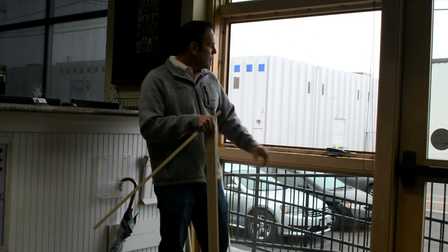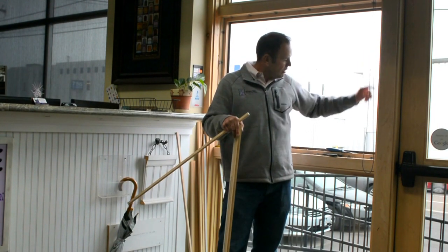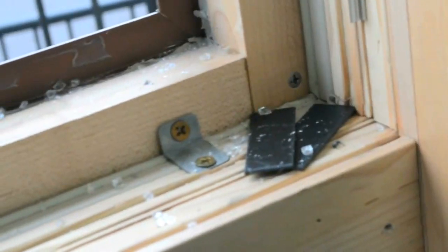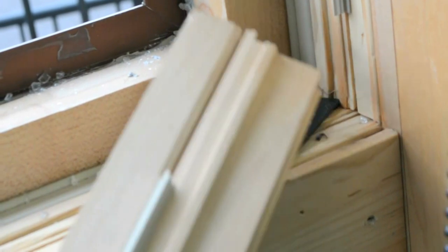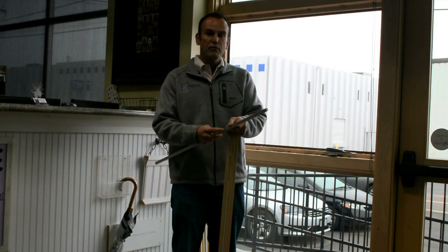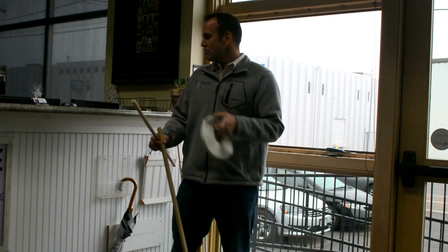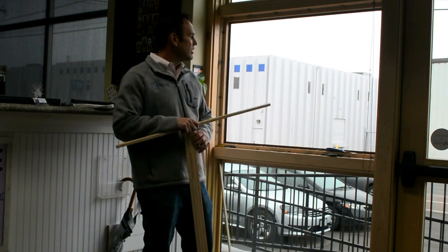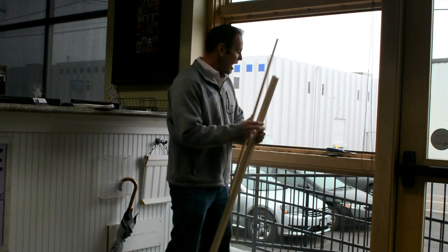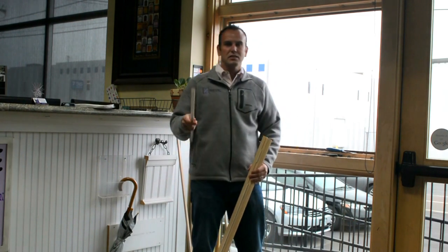As you can see there's no glass in here now, but these adjacent windows do have the glass — so when it's done, obviously this is what it's going to look like. My guys are cleaning the window frame so that all of the old glass and silicone is cleaned up very well. Then they're going to put new silicone through here. What I'm holding in my hand are the interior stops — the pieces of decorative wood that hold the glass in, as well as screens and other details. First you have to take the stops off, and that's where you see the exposed insides. This piece right here is the glazing stop that actually holds the glass in.